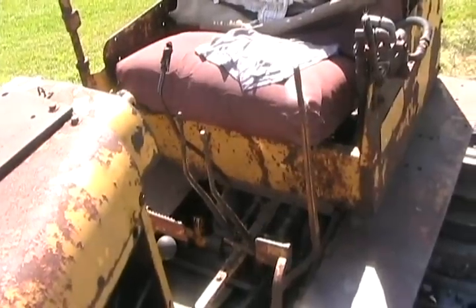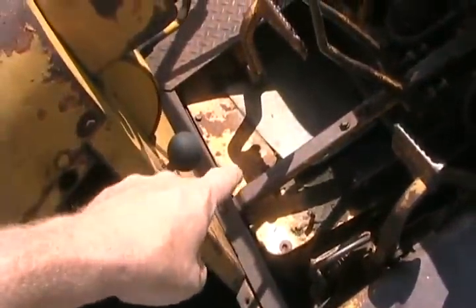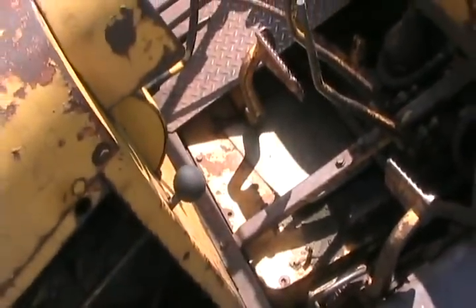This dozer is kind of unique compared to modern dozers because it has a manual clutch. It has a big flywheel under there, a pressure plate, and a clutch disc — just like a car, but really big — and it's manually engaged by pulling on this lever. It goes click. You leave it in neutral when you're not using it, or else the disc rusts itself to the pressure plate and flywheel, and then it's engaged all the time, so you can't put the thing in gear when it's running.